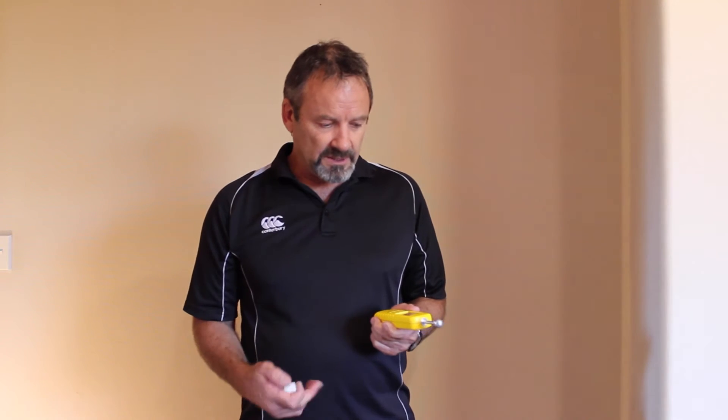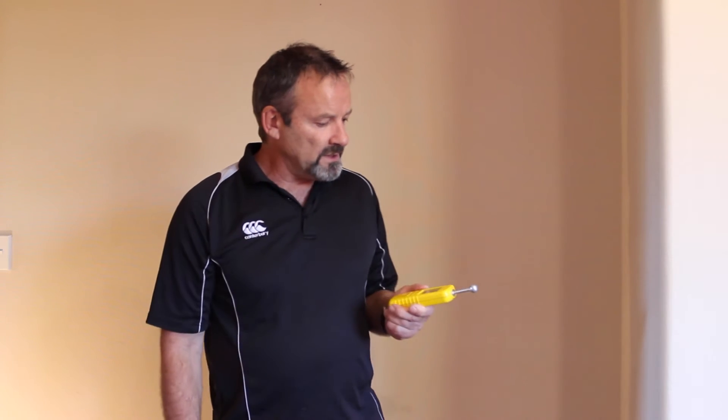When you're using your moisture meter, it's important that you use it properly. Now that you've learned how to set it properly, it needs to be used properly. If you have it too close to a corner when you're using it, it will increase the reading because it starts to pick up the other wall that you're close to.